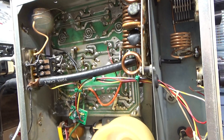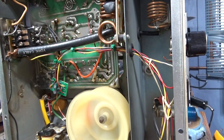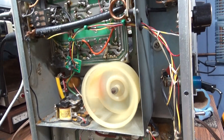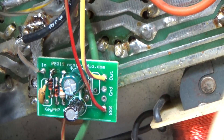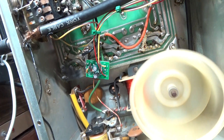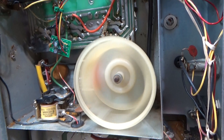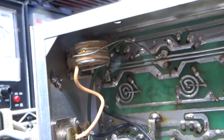I never could get the key-in circuit to work on this. The original schematic I couldn't find, and I had two different schematics for Varmint but they didn't match this unit. It looked like it was miswired and somebody had played with it. So I pulled the key-in circuit out and put in a Nomad key-in circuit — that little board right there. The Nomad circuit uses more modern components, so it works better and has more dependability.